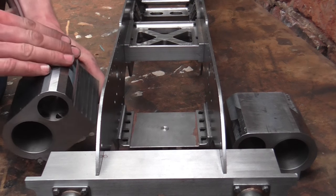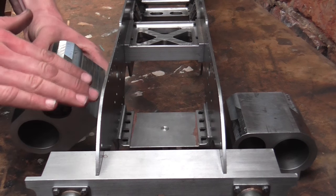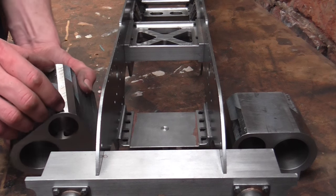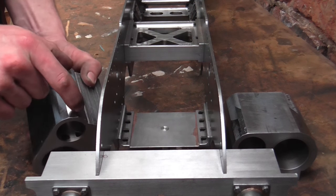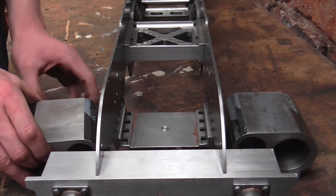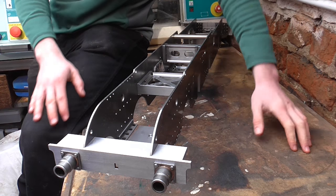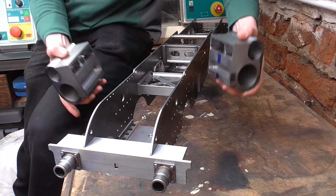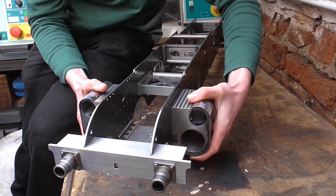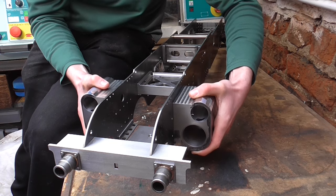I just did that with a face mill working down to a guideline that I'd scribed on, so I just held this in different angles in the milling vise and face milled down to near the line. Probably in the next video I'll actually radially mill these to give a nice milled surface, and I'll be milling out a strip all down the middle where the insulation will go. If you haven't seen the chassis yet, have a look at the videos called 'Assembling the Chassis.' Basically the cylinders will sit on somewhere like this, and what I've got to do with these hole positions is work out how to get them both in the same place, both in the right place, and both of the right alignment.